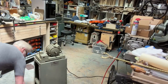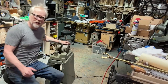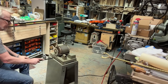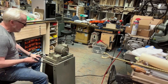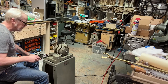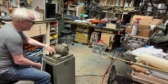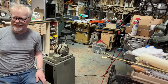All right, so what I've done so far to make this operate a little more quietly, here we go. Yeah, it was rattling. It was rattling because these edges were rattling, and also the underplate was rattling, so I put nylon screws between the motor and the base plate. I put some wood washers between the base plate and the stand. I've added a central pin to keep that plate from vibrating, and now I'm ready to start rebuilding it again. Here we go.